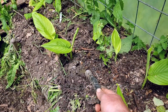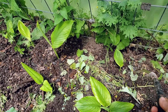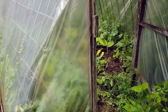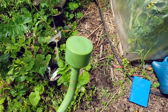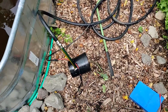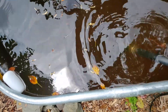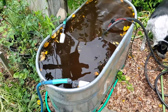I'll put notes in the description for some of the details of what you can search for. For $20 for the pump and $40 for a battery — or it could have been a free battery or a used solar panel with cracks in it — a 12-volt system lets us pump the water very comfortably while we get the soil in here extremely hydrated. If this were extremely mucky soil like the bottom of a pond with lots of algae or mud, we'd want a better filter around that pump. But bilge pumps are pretty good at handling a fair bit of debris, and this tank is relatively clean.